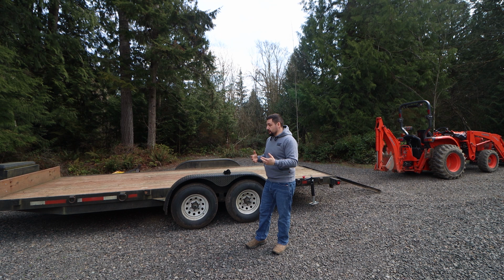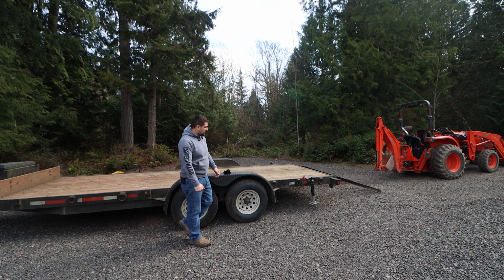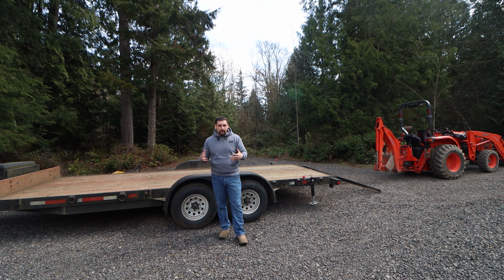You'll see on my trailer I have lots of tie-down points. I have stake pockets, which you can use with chain. I have tie-down loops all over the place. And that gives me the ability to tie down the tractor at the proper angles, depending on how I'm hauling it or where it is or what size of vehicles I haul. Because I don't just haul my tractor on here. I haul other people's tractors on here and other equipment. There are other links in the description about that stuff.